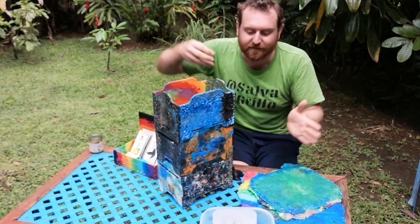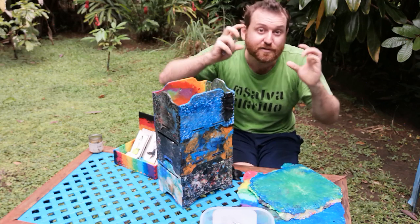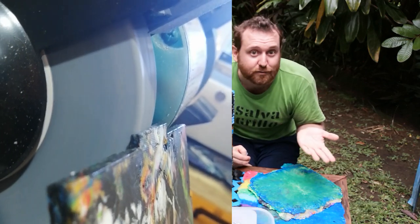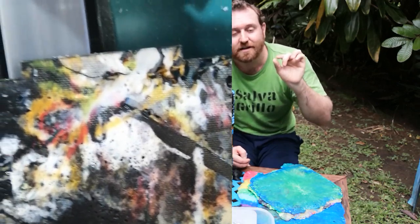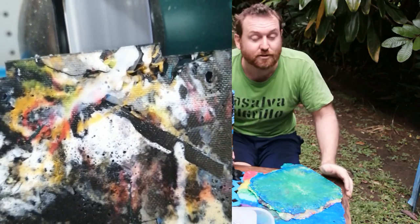When you're using funky sheets like this, it's better to overestimate how thick your sheets are going to be rather than underestimate — because you can always fill in gaps by remelting, but if it's too thin, you'll have to grind stuff down and smooth it, which is also doable. It's much easier to just plan for a little too much thickness.